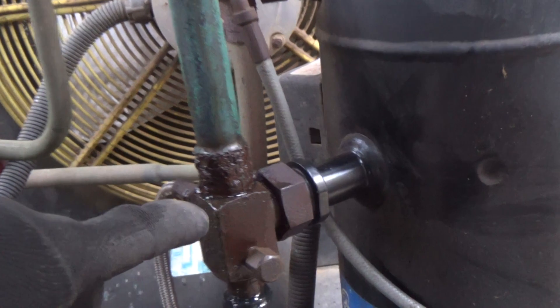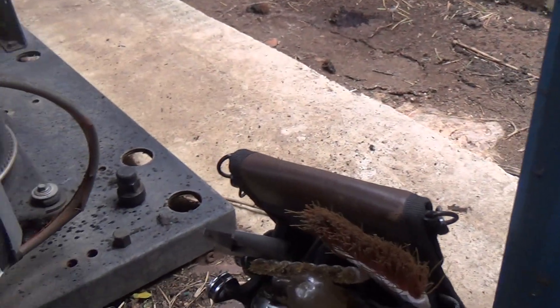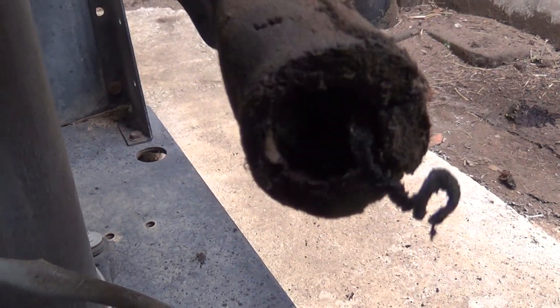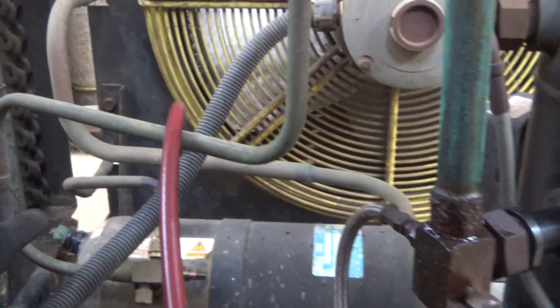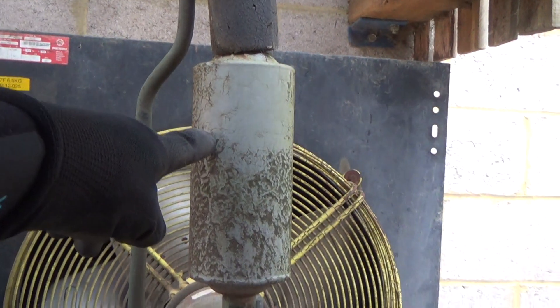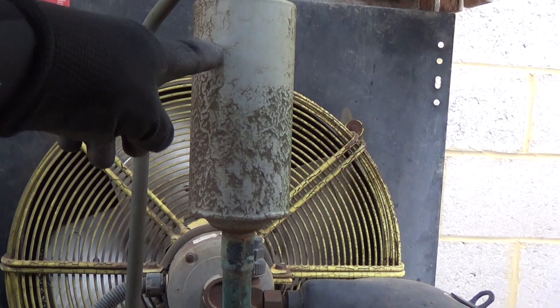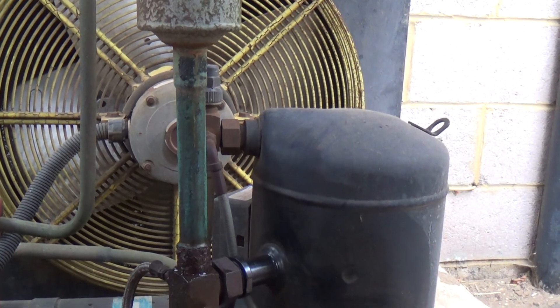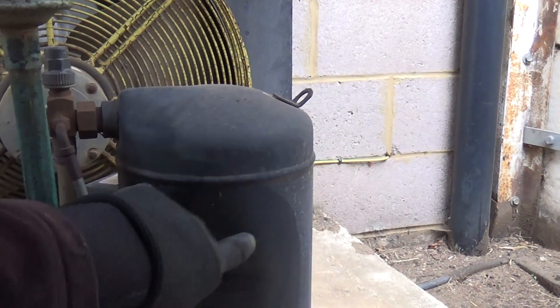The other issue is that the suction valve's really rusty and the insulation's got a sort of oil stain to it, so I think it's been weeping. So it wants a new plug, new valve, and we can do away with this burnout dryer that's been in there - probably 10 years ago we had that compressor fail.